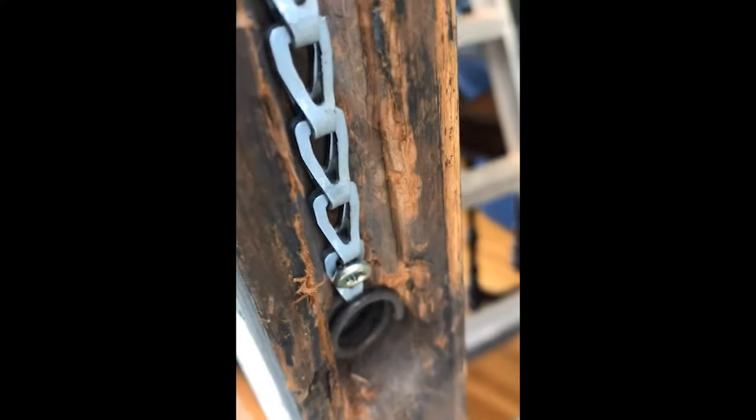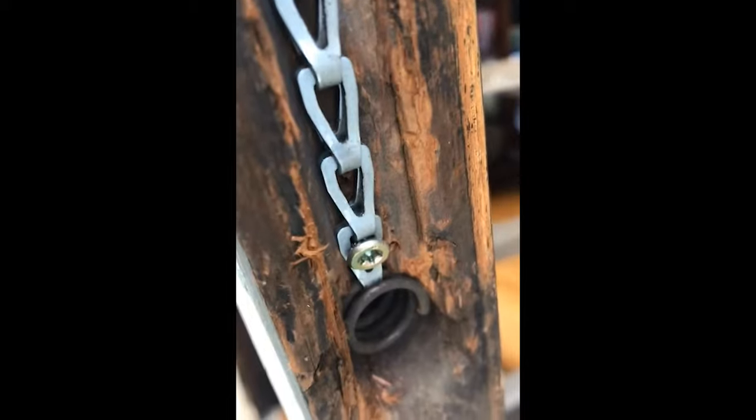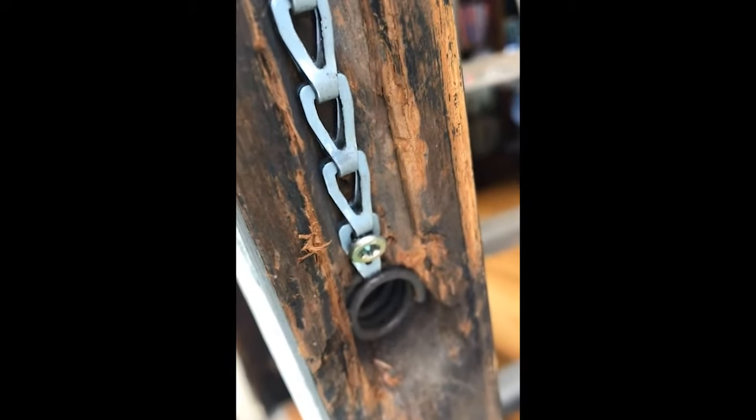This is the entire length of the chain. Here's how I situated the screw — I don't want that spring coming out and rubbing on the window when the chain breaks. Just one screw to keep that spring in there, angled up, and we're good to go. On this sash, the weight has always been exerting force on that chain, so it holds it up. This one is the one we've been working on.